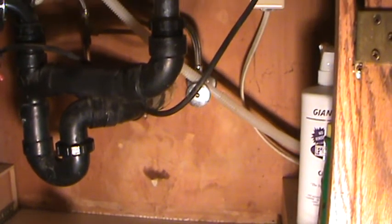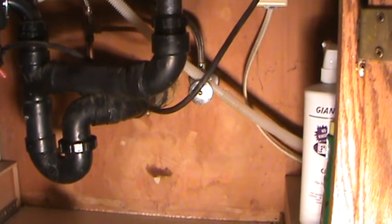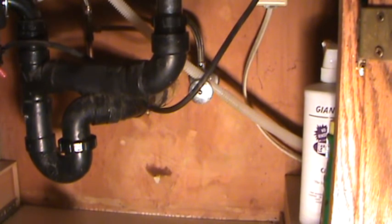I think I found the culprit — nothing's dripping now. That water gate valve, when I turned it back on, it's an old one. When I opened it up all the way, every once in a while it wanted to drip in the wide-open position. I just turned it a little bit like I was closing it — about one turn — and checked it again, and it stopped. I think that old gate valve needs to eventually be replaced, but as for now it's not dripping.